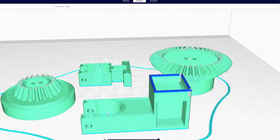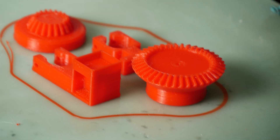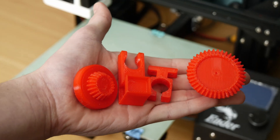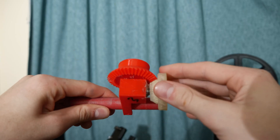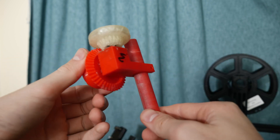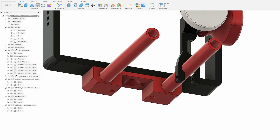For version 2 I adjusted all of the parts to be more precise and efficient. The gears turned out great with lots of detail, however the use of potentiometers was very imprecise, giving me varying results that I couldn't accept. Another problem was that the mount I designed couldn't even allow the friction gear to make contact with the lens, so that needed a redesign. I decided to not cut any corners and make a system that mounts out of the way under the camera rig and is more user friendly.